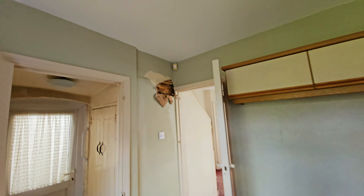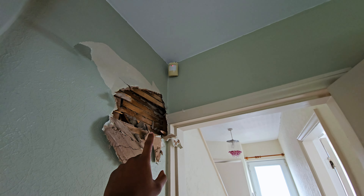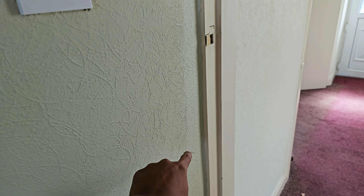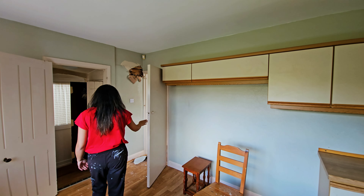Basically, that massive hole was knocked out to find out exactly what that area of the wall is sitting on — is it timber or brick? We established there's a brick wall in there. It slants and isn't tall enough to accommodate an RSJ beam going across, finishing off about here. So the engineer gave us an option to put a steel post over here — that goes high enough to support the RSJ beam from that end all the way to the other end.